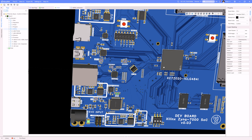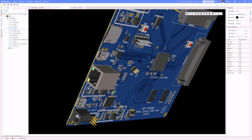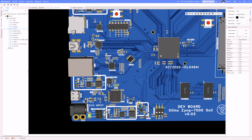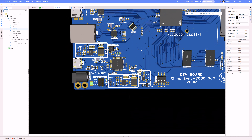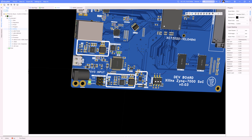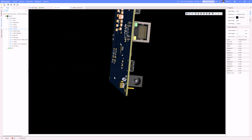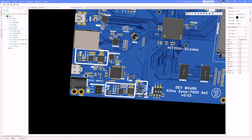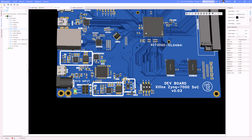Coming over here I've got my microSD card along with its supporting IC. I have a USB-A/B connector so I can be either a USB host or USB device, with a PHY that goes with that. I have a USB-C port to bring in 5V, along with programming and serial communication. I can also bring in 5V through a DC barrel connector, and I have jumpers to select which provides the 5V. In most cases I'll probably use the DC barrel connector. I also fused that along with a fuse for the USB-C.